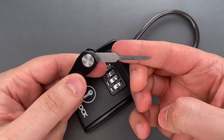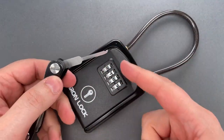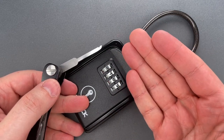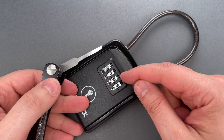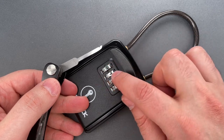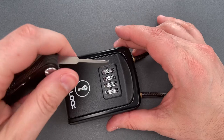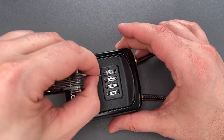I'm going to use the notch on this decoder to grab a bar that runs behind these wheels. I will then pull the bar into the wheels binding it against them. Then I can just turn the dials until I feel a loose spot in the travel, and that should be the digit of the combination. Let's get started.